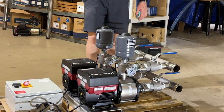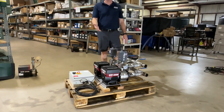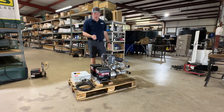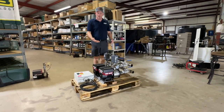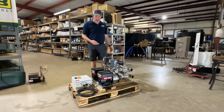This pump is incredibly smart in that it will alternate pumps in order to evenly distribute the workload. So if pump number one has been running the longest and the pump shuts off because there's no demand for water, the next time the pump turns on, pump number two will come on first, and it will alternate back and forth in that way.